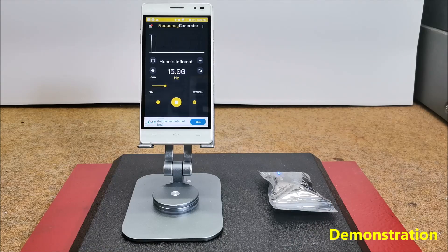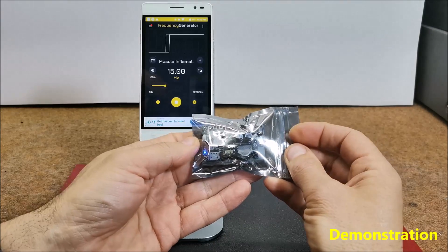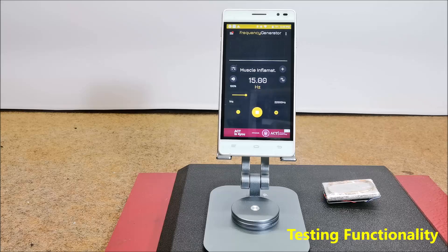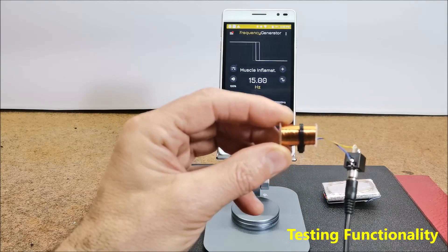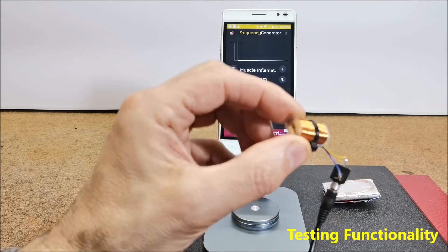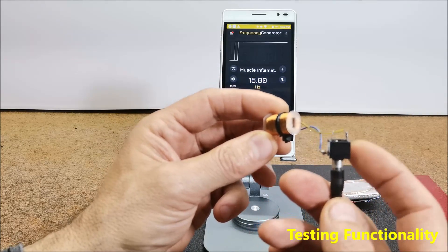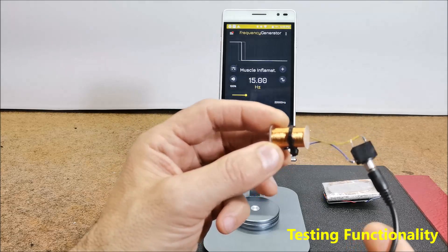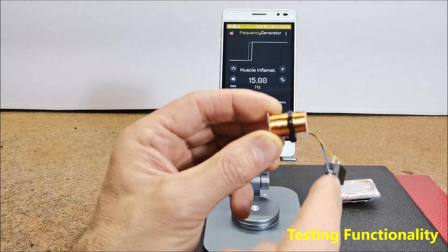I leave it to your imagination to come up with a miniature, light, and strong case. To test the device in the simplest way without expensive instruments: we need a small coil with multiple turns — specifically a relay coil with the iron core removed. The outputs of the coil are connected to a 3.5mm female audio jack and then via a coaxial cable to the microphone input of the PC. If the device is functioning normally, the generated magnetic field induces voltage pulses in this coil, which are heard on the PC speaker.